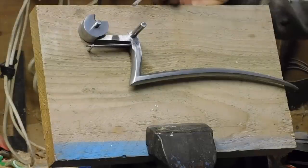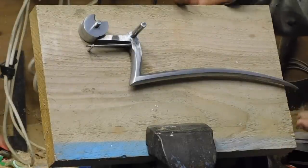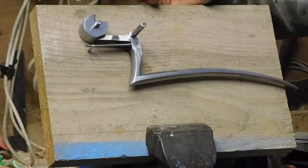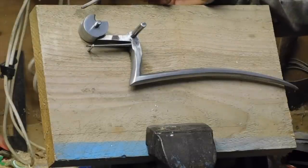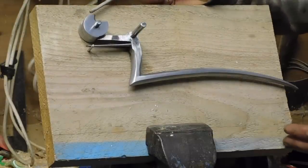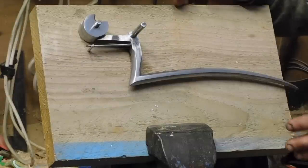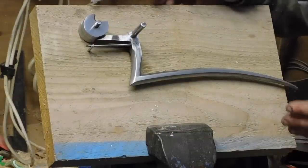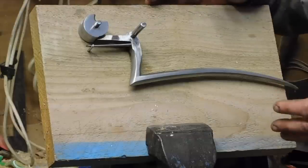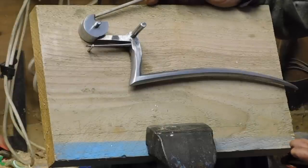That solid thunk is a very reliable thing, because if it's not properly engaged and you start to take the pressure off the goat's foot lever, and the string slips when you're half an inch from it, it's really going to hurt your hand — shock your tendons, pull your hand into the bow, all sorts of unpleasant things. It's a bit like brakes on a car: with a bow, if your trigger functions properly that is the singular most important thing, because if you can't trust your trigger you're always going to be scared shooting the bow and it's always going to be dangerous.